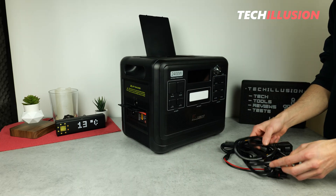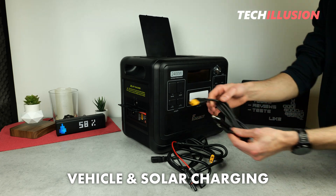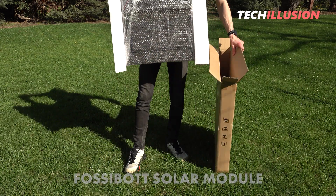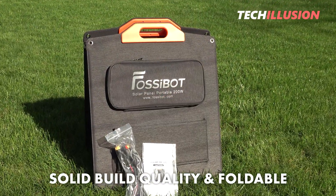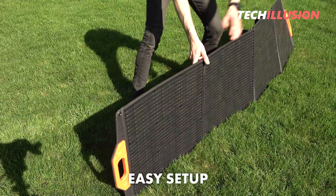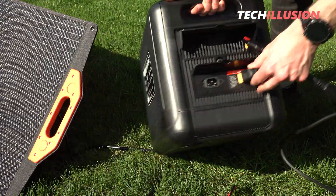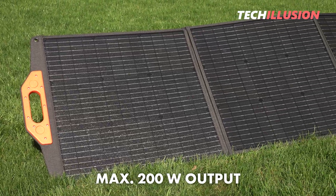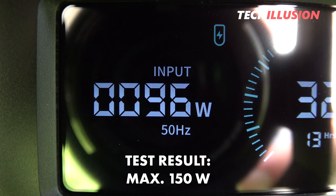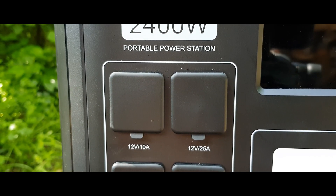As mentioned earlier, the package includes a suitable power cord and an appropriate adapter, so we can charge the device directly from our vehicle or use solar panels with the XT60 connection. FossiBot also offers a powerful solar module that makes a very good impression in terms of craftsmanship — it's foldable, super easy to store, and easily transported thanks to its handle. Setup takes just one or two minutes. The manufacturer specifies a maximum of 200 watts; in practice I measured a maximum output of around 150 to 160 watts in direct sunlight. With this huge capacity, we can easily let the solar module charge the power station throughout the day.